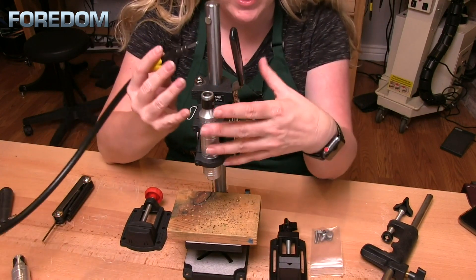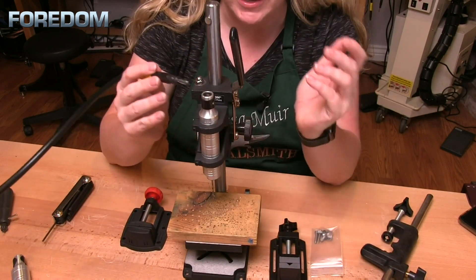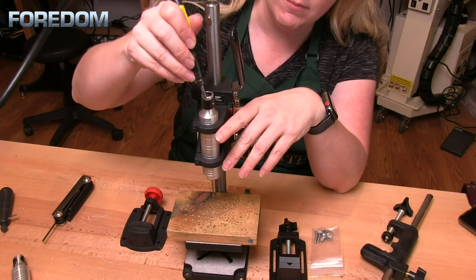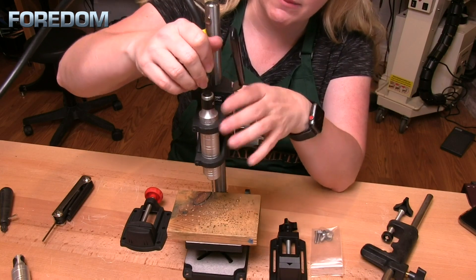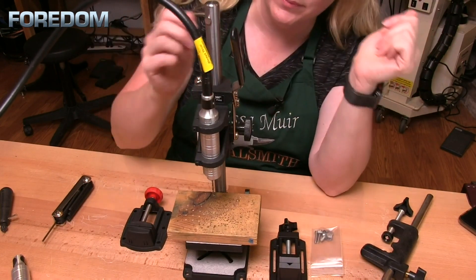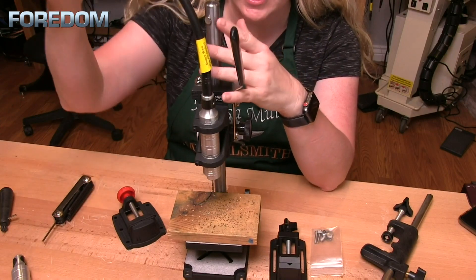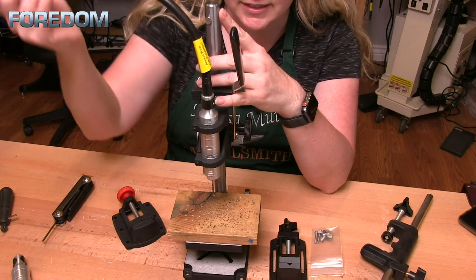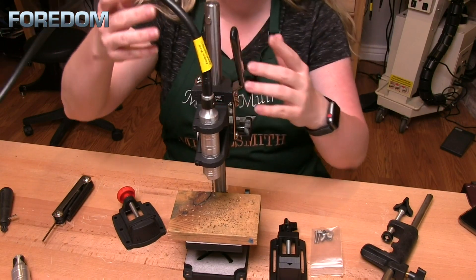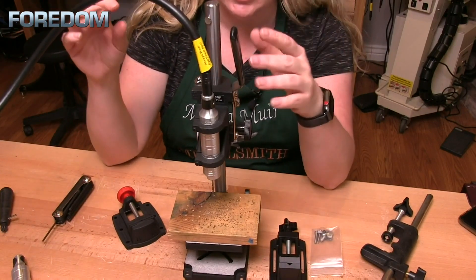Here in my studio I have a dedicated handpiece for the drill press so I don't have to worry about putting it in or taking it out. I'll start my motor, get it into position, and click it in just like that. Now at this filming bench my flex shaft sits a little lower, which isn't ideal — I'd prefer it to come straight down or at a higher angle. You don't want too much of a curve going on with your flex shaft.